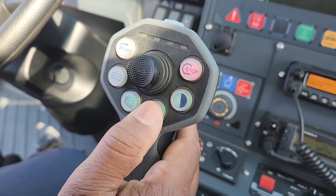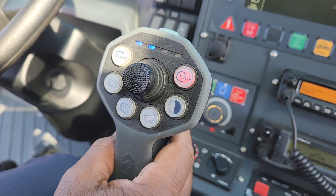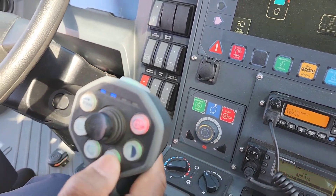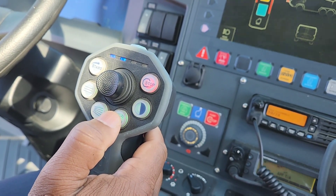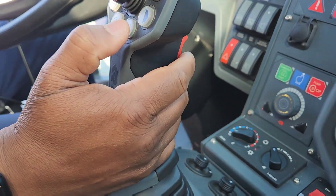Press and hold it and dry chemical will come out. Now, if you need to inject the water stream with dry chemical, go ahead and turn your pump on, then squeeze the trigger and your dry powder button at the same time, and it should turn the stream purple. Hold both of them — that's how you extend your range if it's windy.